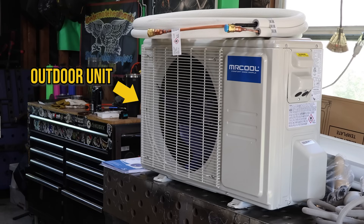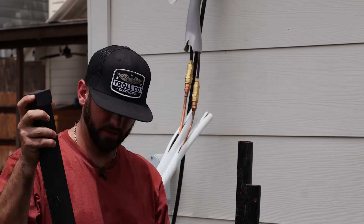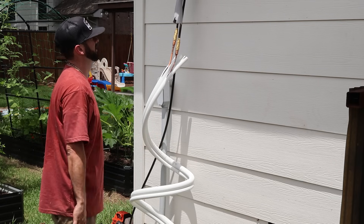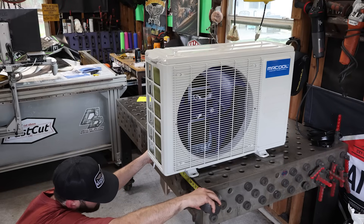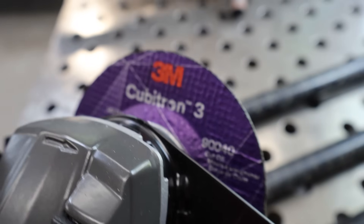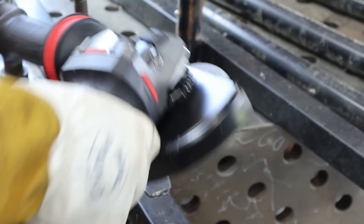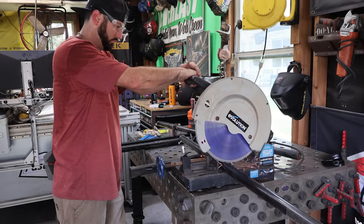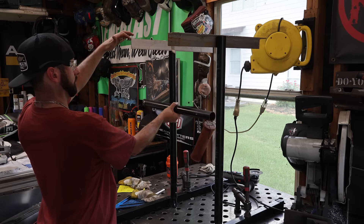On the ground here I've got some tubing — it's already painted. This is tubing from an old hammock that fell apart, but the metal's still good. We're going to build a little stand so we can mount that unit somewhere in this area a little higher — maybe waist high — so if I have to work on it I'm not working on the ground. Building this stand, the first thing we need to do is pull measurements off the condenser unit itself. The legs on the old hammock have two different directions, one at an angle, so we're going to cut off one of each of these little stubs so we have one facing straight up. I'm eyeballing everything — I really am a big fan of eyeball fabrication.